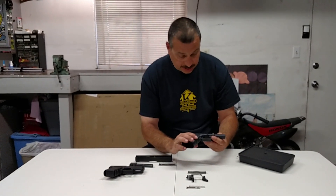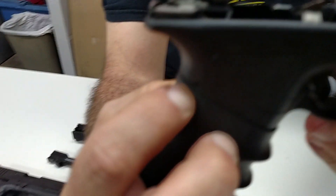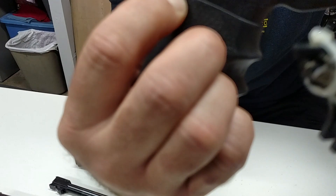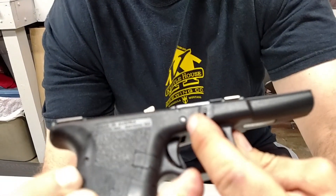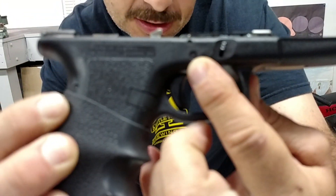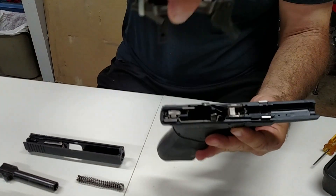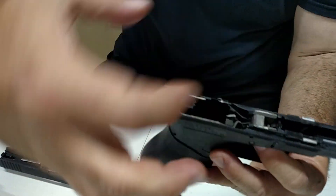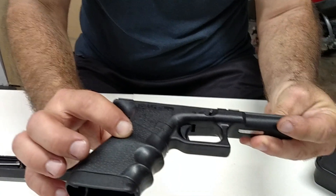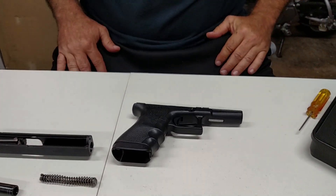It's a real easy install — just two pins. There's one right here in the grip for the lower portion, and then the trigger itself uses this bigger pin right here. You pop those two out and this whole mechanism comes out. It's under a little tension in the back, so you want to keep it together — that's why I have the zip tie. Then you drop the new one in and put the pins in. Pretty simple installation. Changing the trigger is a must on a Glock if you really want to enjoy shooting it.